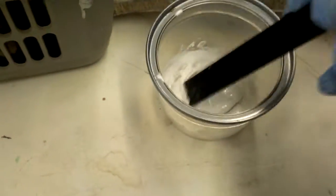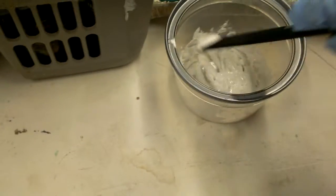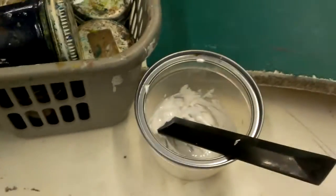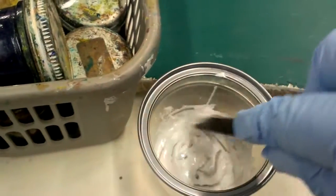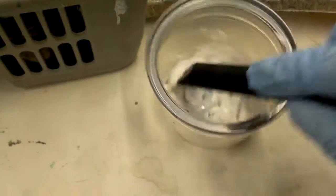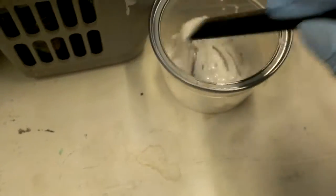Frosting. If you're working flat on the deck, filling a hole on the deck, you wouldn't need any. If you're looking up on the side, you're looking for it some way so that it's not going to sag. One of the things that you would do if you're working on a vertical surface is tape off underneath it, so if it does sag, it doesn't stick.